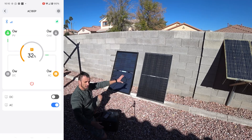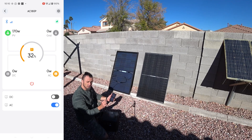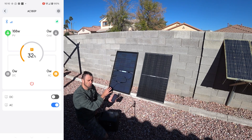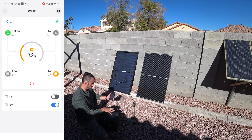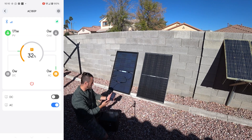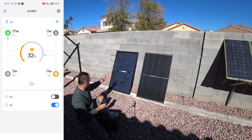I'm going to plug in the first one, which is facing the sun. Right now we're running on the panel facing the sun and we're getting a wattage reading on the Bluetti. At 10 o'clock in the morning — 170 watts. That is awesome. For 10 o'clock in the morning with a very low sun in winter, 170-180 watts. These panels are rated for 200 watts, and with the losses in the system and wiring, and the fact that it's not a perfect summer day, I think that's excellent.